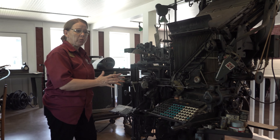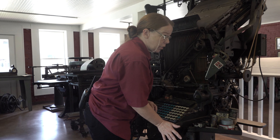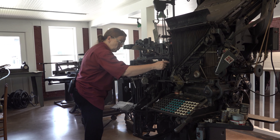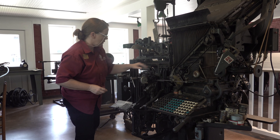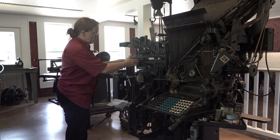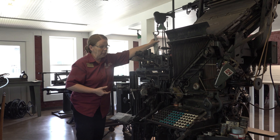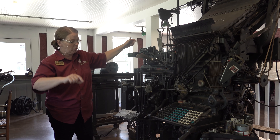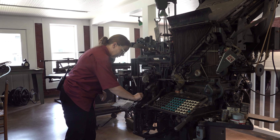Pretend we have created one sentence — we're ready to cast it. Normally this little guy is stationed right here because he's going to push your full sentence over, since this is a sliding track. This arm or elevator is going to take it and roll it down in front of this wheel. This is where your hot molten lead is at — it's got a plunger that's going to go into the lead, force it out, and give you a casting or a deposit of a slug.